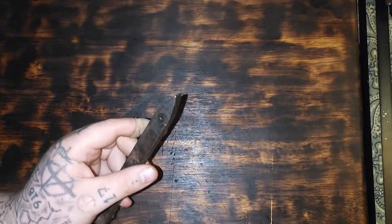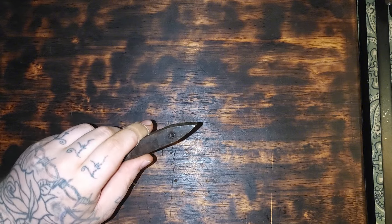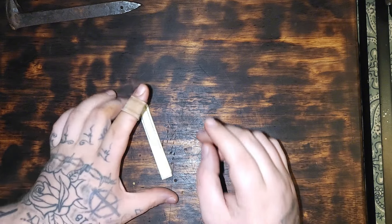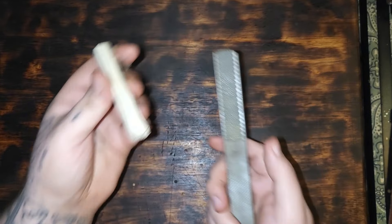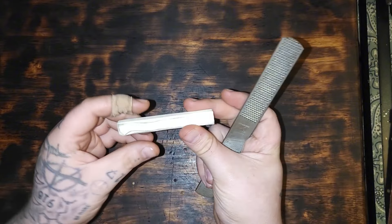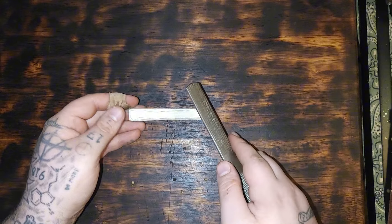Got that hole drilled through there. I got to stick a needle file in there and adjust the shape so it's not just a circle, and then we'll be grinding everything down. But first, because I got to grind this with my angle grinder and stuff, we're gonna go ahead and skip to the handle. I have my outline drawn on this piece of wood, I'm just gonna take this four-in-one rasp and file, rasp it down to just about those lines, and then we'll worry about shaping it more, just getting it down to the general outline.